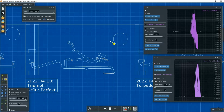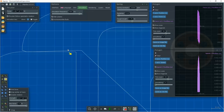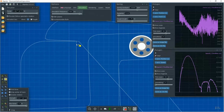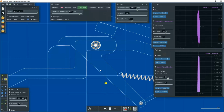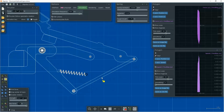But here, we now instead have a rather interesting sort of bell crank, namely a class 3 bell crank. So fulcrum, effort, load, but now our fulcrum is of a sliding form, or technically slightly changes in position throughout the stroke. So again, as I had shown on the actual machine, it starts over at this point, then flattens out and shifts to this corner over here, and while in that state, it's able to have some minor sliding there, you can see over there. Alternatively, you could regard this as a class 1 bell crank, at least from the reference point of the key lever, and with that, you have a force coming over here, starting from this side, eventually progressing to this point. And then that applies torque, which rotates this end with the load, which finally pulls our type bar link, like so.